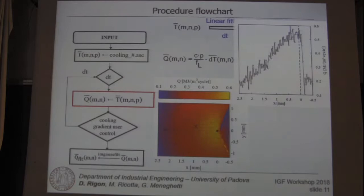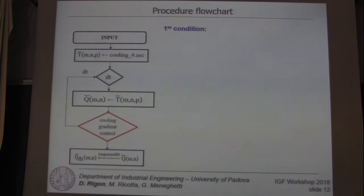Here also the distribution of the Q value along the notch bisector. The data has to satisfy a condition: the R² of each element of the ΔT_ij matrix has to be higher than 0.985 for each pixel.